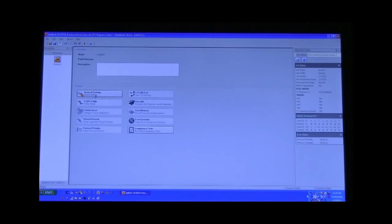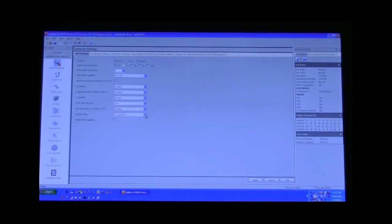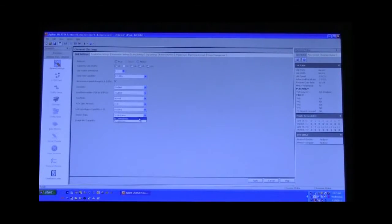First thing that you'll notice is that you'll have a general setting for the PTC3, and your compliance tests will be highlighted. Grayed out will be the other options that you could use for this particular exerciser card. So we go into the general settings. Under the compliance tests, we will deselect the by 16, by 8, and by 4. We only need to run a by 1 test. And since the PTC is driving the device under test, or your add-in card, the data stream is going to go down, not up. Select Apply.